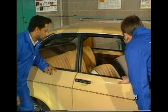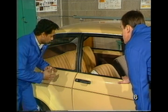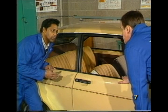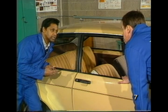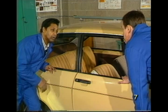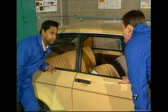Right. What about inside the car? Lots of flammable fabrics in there. Yes, depending on the job that we're going to do, the carpets and the seats may have to be removed. Similar, when on the opposite side of panels, trims may have to be removed, as well as under seals need to be scraped off and so on. Especially we have to be careful about hollow sections where wax has been put in as an anti-corrosion medium.